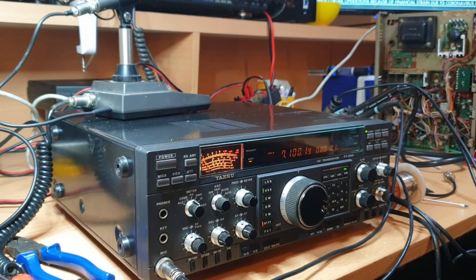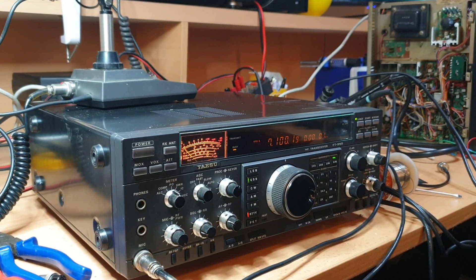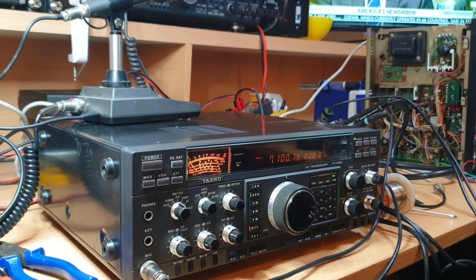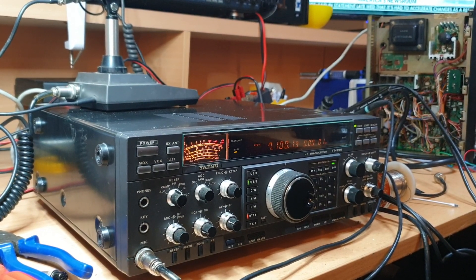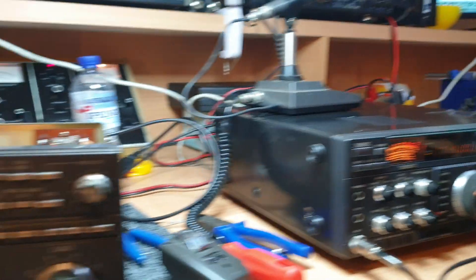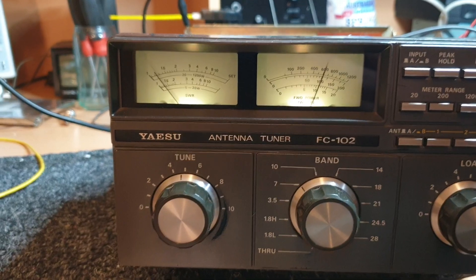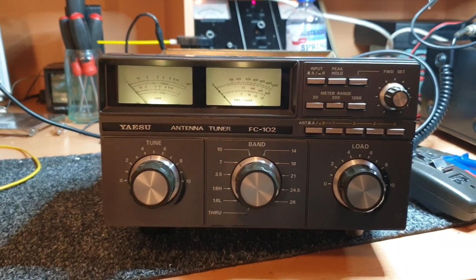They're pretty good, but do remember that they're a semiconductor. A lot of these old Yaesu radios — we were talking about this the other day — the 767s, the 107s, the 990s, the 1000s — all solid state, and their foldback circuits were early days. Whilst the foldback works, whether it's quick enough to catch a terrible flashover, sometimes components can do some very irregular things. So tune up at low power — come into this thing at 5 or 10 watts if you can, and as you get tuned close to your tuning range, you can increase the power like we just did. Right now I'm not hurting anything because I'm 1 to 1 going into a beautiful 100-watt dummy load and we're getting 100 watts out, and that's fine. I mean, I'm not going to do it all day — that would be silly.